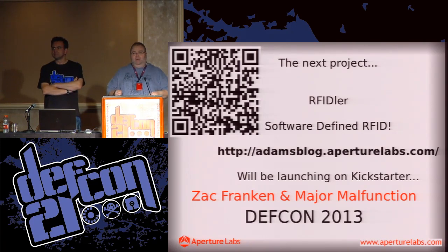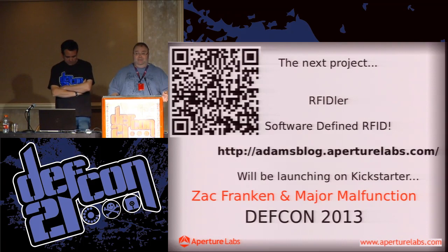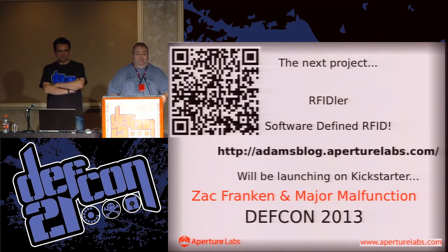So we looked at an RFID vendor and their latest and greatest product, and they'd stored their keys in a PIC chip, and we sent it off to a slightly dodgy company. And they said, oh, that will be $900, sir. And they sent us back an entire dump of the code, including all their super secret keys. And we've had chips reversed that have cost as little as $90. So if you have a cheap PIC chip, $90 will get you the code. With the higher end chips, they actually put some effort into preventing this, with proper on-die security.